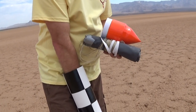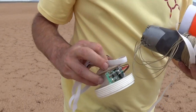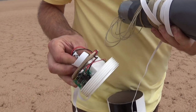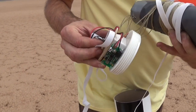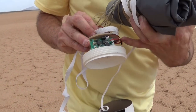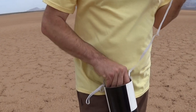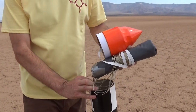Based on the Eliminator 6 failure, we've changed the positioning of where the flight computer is located. We really believe that there was a g-force issue that ripped the battery out of position for Eliminator 6. So we've changed the flight computer and the battery from hanging down underneath the mounting bracket to being on top of the mounting bracket, so it really can't fall out of place from g-force. That should really be helpful in maintaining the integrity of the flight computer and the battery.